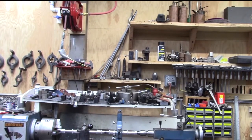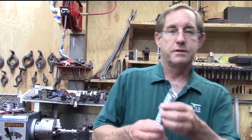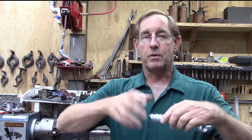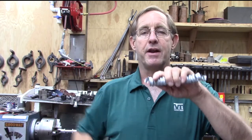And what these parts are for is conduit. Typically you have a part that you screw into your conduit that you can put into your box, your flexible conduit. Let's call it that. Here, I'll grab a piece of it. This is your standard flex conduit, and you'd have a little part that would screw right into that, no problem. Go into your box, you'd have a nut on it, and tighten that up to your box for your electrical wiring.